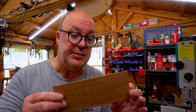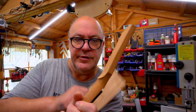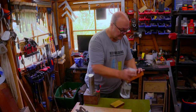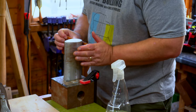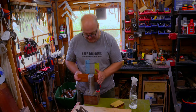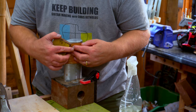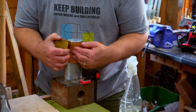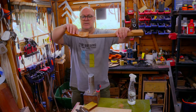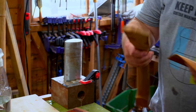I've just dimensioned up this piece of mahogany — it's a piece of acoustic guitar side — and now I'm heating up my bender with the intention of bending it, because I've got this volute that I need to get into, so I need to bend it to go around that curve. It's cracking. There's always the possibility that this will just crack and go snap, but we'll go at it nice and gentle and hope that it doesn't do that. Yeah, we're getting there — I think that's going to work.